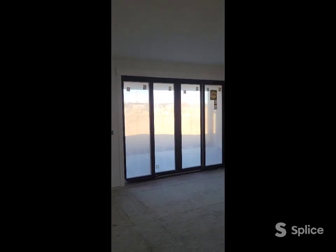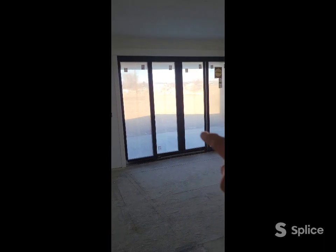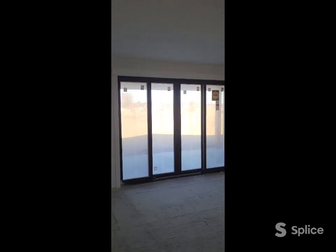I find a little technique — I do the same thing as the case opening on these sliders when I case out the sliders. I'll build up the jamb all on the floor, put the casing on, nail that on with a quarter-inch reveal. Then I just start walking it up. I'll pick up the header and gradually lift it. On this one I actually had to start right about at this level on both sides and then get it set to where it would stay, then lift one side up a little higher, come over and lift the other, and lift it up again. It wasn't very fun, but I got it in there. Luckily it didn't fall back out.